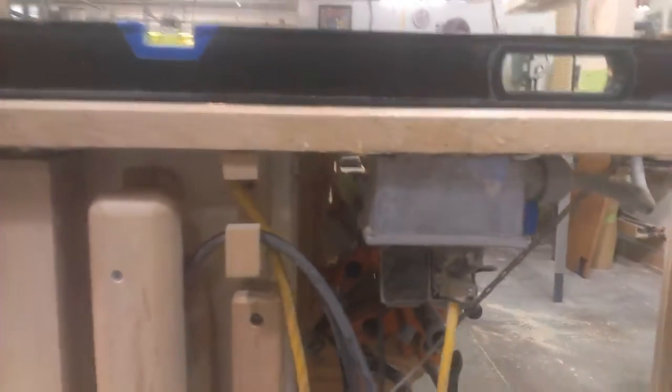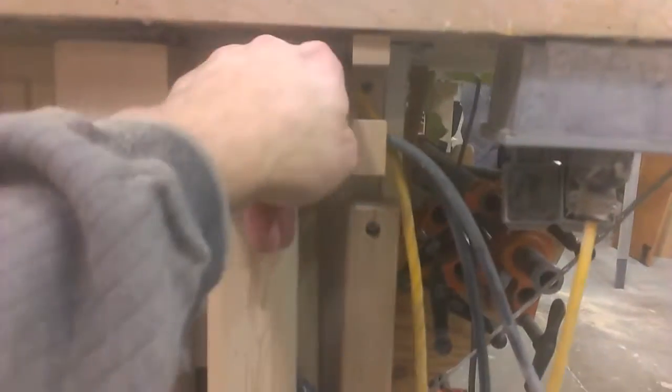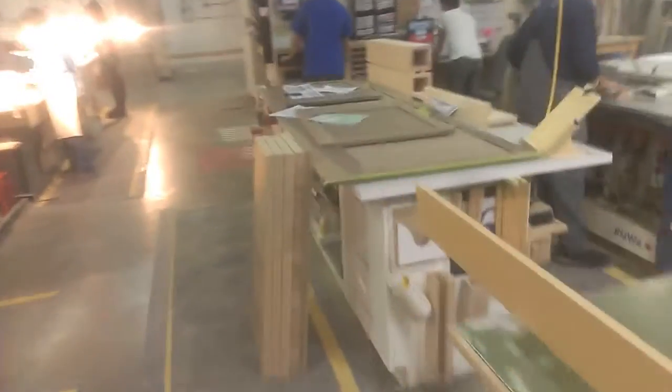A couple things I had to do here. This table was really warped, curving up past the end of my cabinet. I actually used this metal strapping and screwed and pulled it down nice, and that brought it straight. See how there's a gap here at the top of the cabinet? I'll pull down on it here — you can see that gap closed. That's what my table had a lot of. I used these metal straps, pulled down on them good, kept the metal part down to a sixteenth or so and screwed it at these screws. Then when I screwed up through, it would flex the metal, but it pulled down nice and hard and kept it tight to my cabinet. With that tight to the cabinet, that makes it straight all the way along this part.